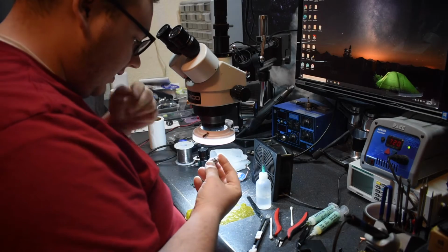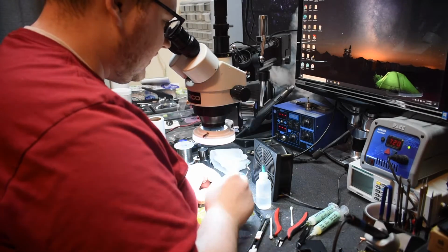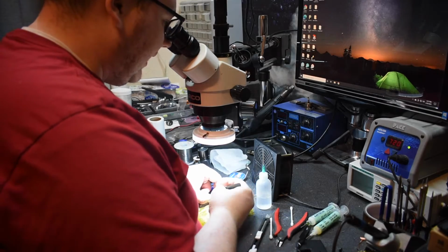And we could just stick the port in and then hopefully solder it in. One thing I would like to do is, thinking about the front of this HDMI connector and this area, maybe applying solder here and scraping up the board to get that to where this would be like a ground pad. Solder that, so we have these anchors right there, and then have another connection right here. That would be really nice.